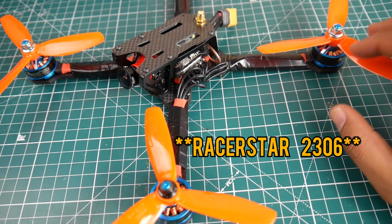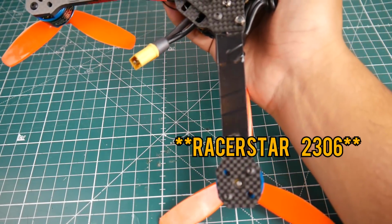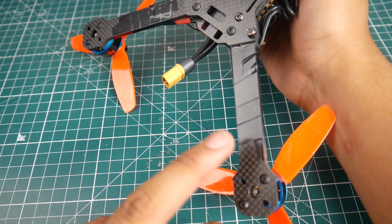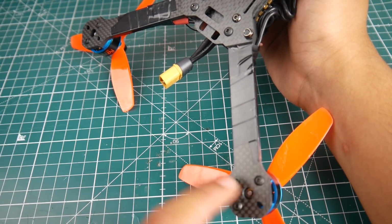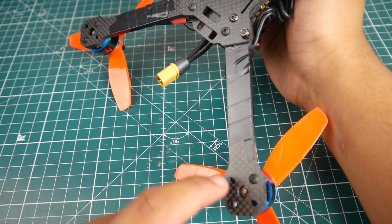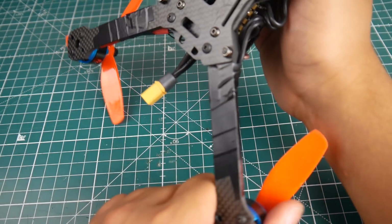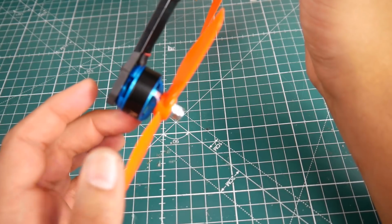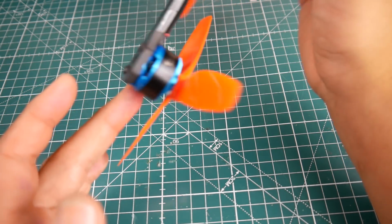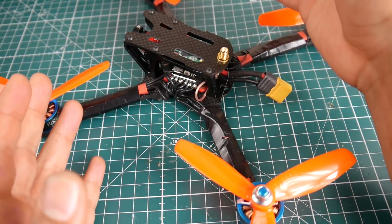I had no issues. Maybe something you have to take note of and be extra cautious of: I used 2 screws to hold them in, because sometimes you can hit the coils on the center part here. You'll have one side where all the coils are gathered, so you kind of want to ditch that and go somewhere else. The way to know if you really hit one is that one motor will be hotter than the rest, and you might get flips of death. So double check your screws, not just on this motor, any motor.